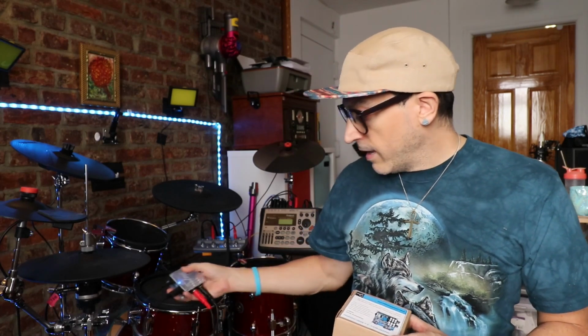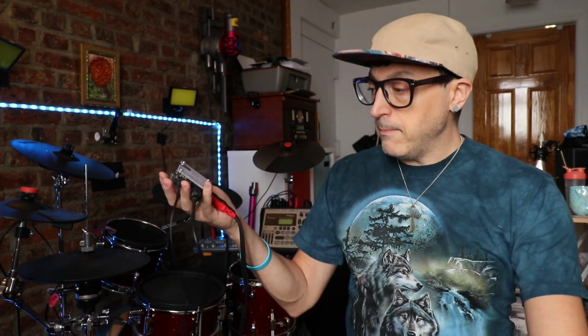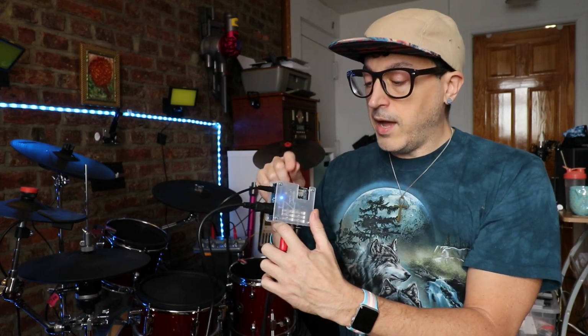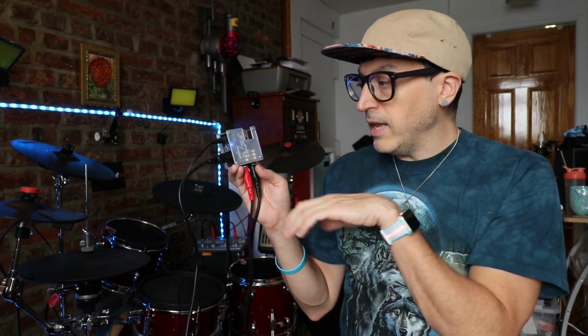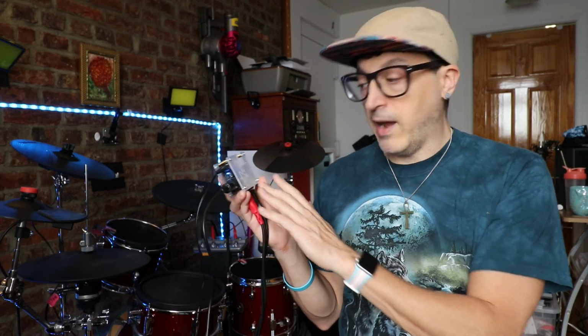And what you can do is, I have it over here already hooked up. What this thing actually does is it has a single MIDI input, some audio outputs, a micro SD card slot, a headphone output, a volume knob, and a power input. So basically it just runs on a regular guitar pedal power supply. You plug a MIDI input into it, and then the MIDI signals come in and trigger samples that are inside of the device.